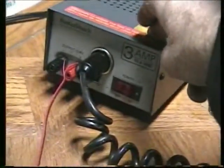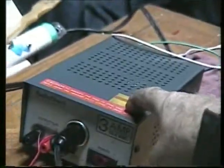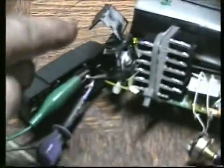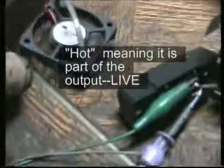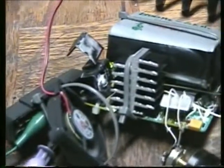This is a 12 volt, 3 amp power supply from Radio Shack. I've blown the transistor in that thing once, so I had to replace it. This high voltage walks around — it doesn't like to stay in one spot. The fan is a 12 volt fan. I probably don't even need it, but I've got to watch this heat sink here because it's hot — that's part of the output. It might be the back voltage that keeps popping those things.